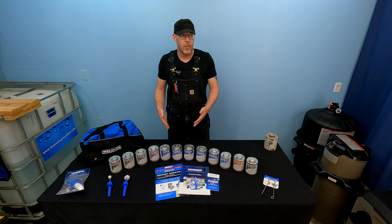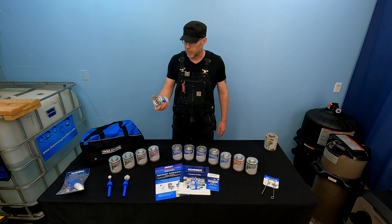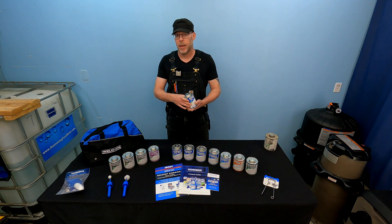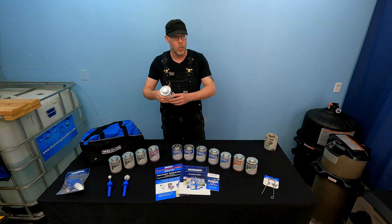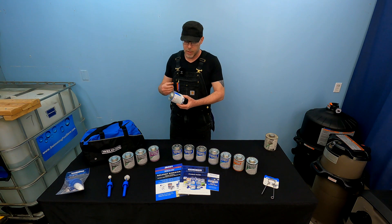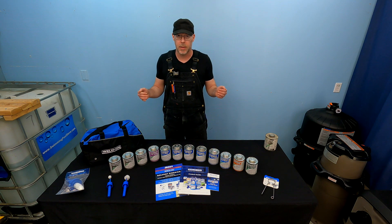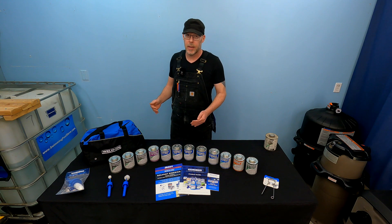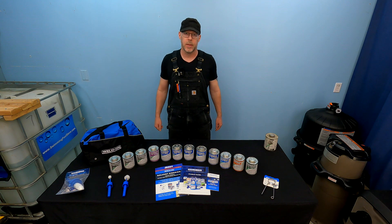So why did I choose these ones? A hundred years ago when I was first doing this stuff, I just picked them at random. But I've grown into appreciating the technicality of the rules — what is it actually for, and why am I using the wrong thing for the wrong application when there's a better product available? This heavy-bodied stuff is intended for large diameter pipes — much larger than we work on in swimming pool and spa installations. You're going to need the regular-bodied for anything up to and including 4-inch, which is almost every swimming pool installation. Regular-bodied is all you need.